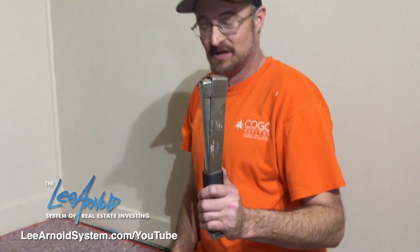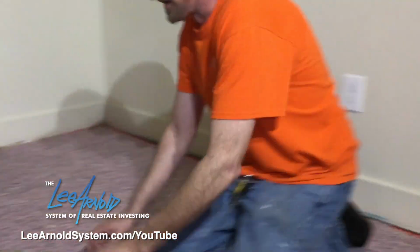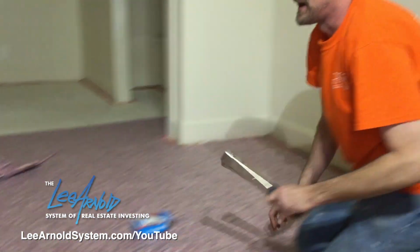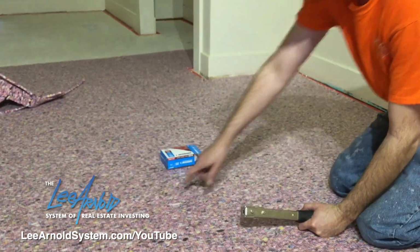And so before I begin, I'll let you know how to use that hammer tacker. Don't do it lightly, because you got to make sure those staples get down into the flooring below the pad. And you want to have it nice kind of level. And then that way, I'll just keep on going. And you'll probably staple about every 6 to 8 inches. You can go more if you want to, but I find that usually works out the best. And so we'll continue on stapling.